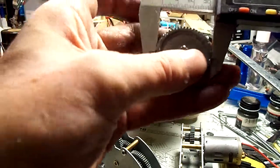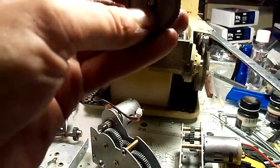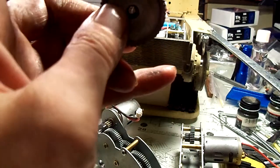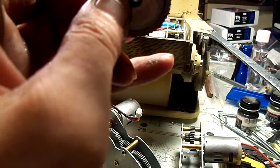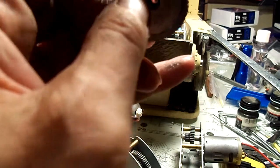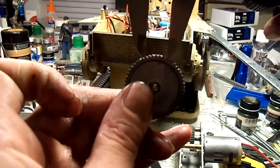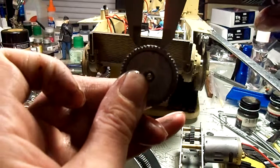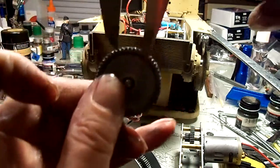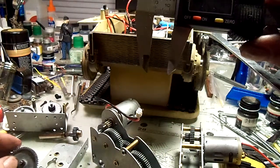33 millimeters — yeah, that's what that size is. Now I'm going to use standard for the next measurement, because in the gear business this is what we call a span measurement. You count however many teeth you want — on this one I'm going to use seven. That's a good lucky number. You measure across there with your calipers — that's called a span measurement. You're measuring the span between those two teeth that are seven teeth apart, and that measures to 4.745 inches.